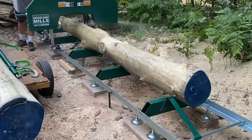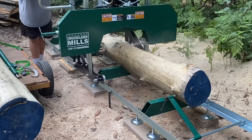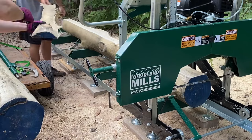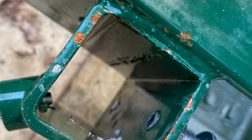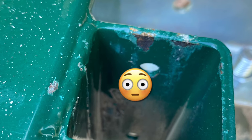We mentioned how we had initially set up our sawmill on a car trailer. For the first five months, the mill was stored in our garage and we'd pull it outside just to mill wood. About a month ago we needed to use that trailer, so we had to move the mill outside temporarily. About two weeks of being outside, we noticed several small rust spots already starting to form on the mill. That was disappointing because we have it fully covered — both the sawhead and the track — and it's never been rained on. The rust spots were on bunks and the log stop sleeves, areas that get more wear and tear. Still a bummer to see them rusting almost immediately, with no signs of rust in the previous five months stored indoors.